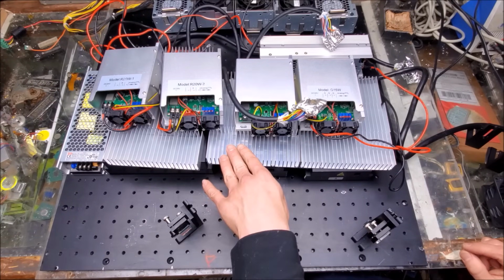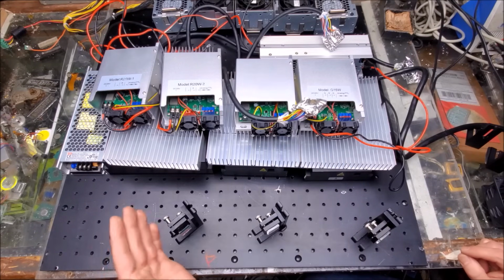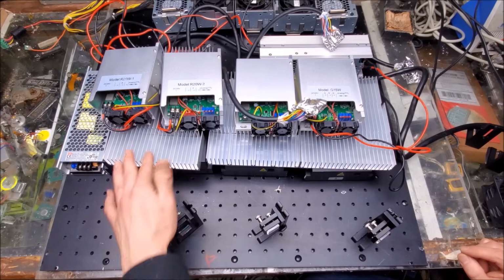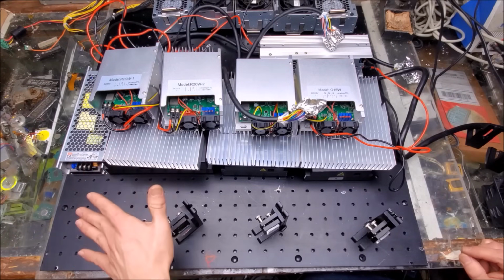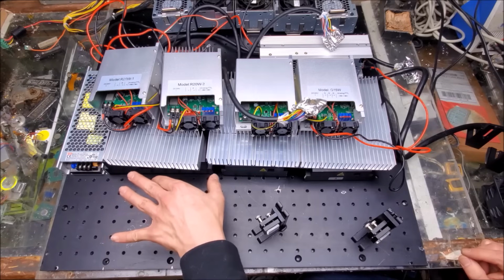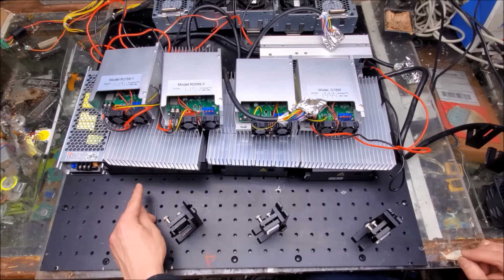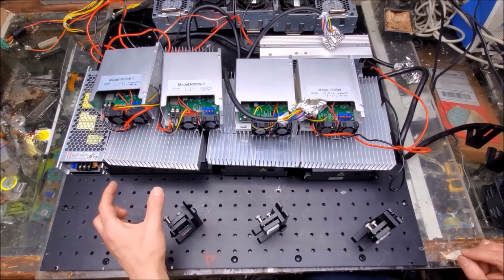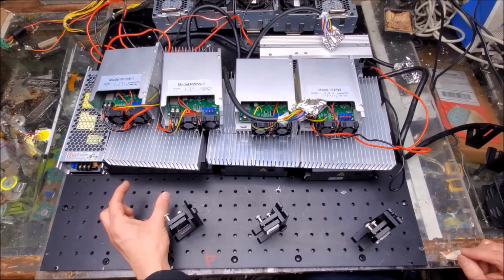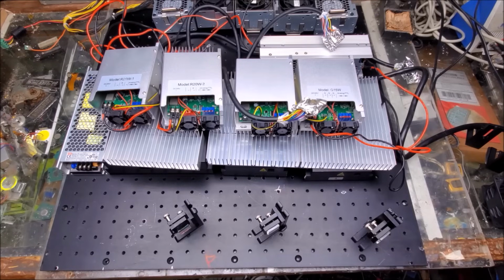One thing to note is that these lasers are actually lower as far as the output level on the front of the laser head than this one. This is actually elevated by about 5mm, and of course all those beams need to line up. So there will be another optical mount here, which will take the output from the red here, reflect it this way, and then forward. So that'll drop the beam down in height to match the height off the optical deck as the other lasers. Now let's take a look at the galvanometer.